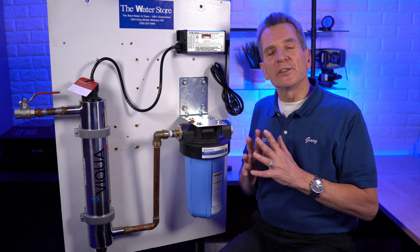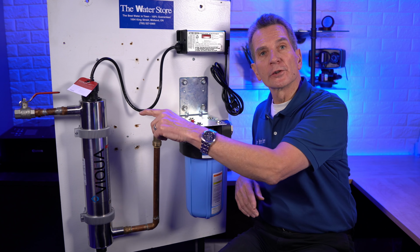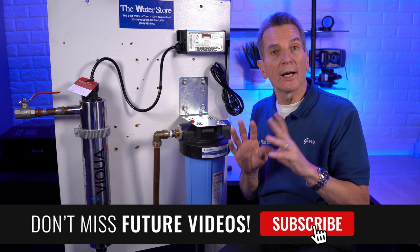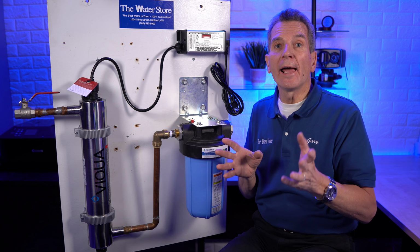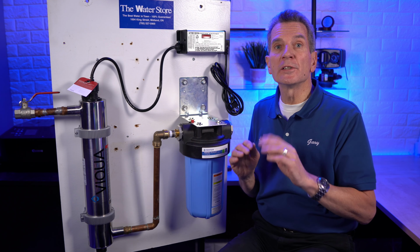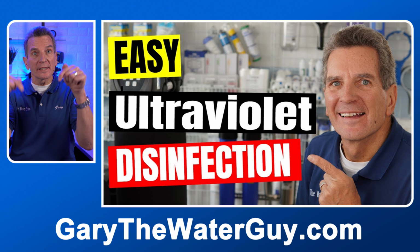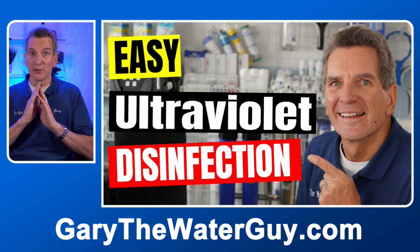So what you need to realize is that as the water flows through the pre-filter and through the ultraviolet light, it's going to kill the bacteria, absolutely. But what about the water that's downstream of the system? Yeah, you drain most of the house when you're putting it through, but there's definitely going to be places where there's water in there. And in a lot of cases, that water may or may not have bacteria in it. So what you need to do is disinfect all the plumbing in the whole house. I've got a great YouTube video that shows you how to disinfect that plumbing. I'll put a link in the description down below. Definitely check it out and definitely make sure during the installation that you do that.